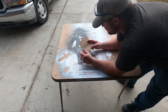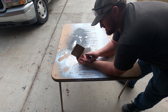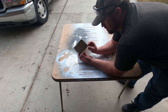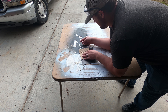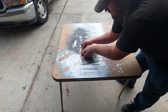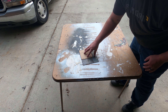Grab my piece of scrap metal, got my template. After I got it up I was looking at it a little bit more. I'm going to extend this out a little bit further because when I bend it, the metal — this corner is going to take up some metal. So how I'm going to do that is, since it's square, I'm just going to offset it off this edge a little bit and take some spray paint to transfer the template.